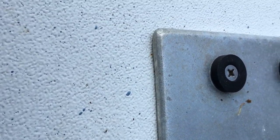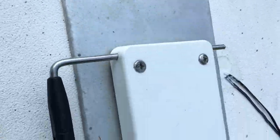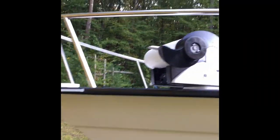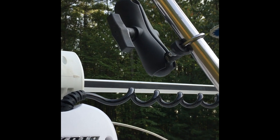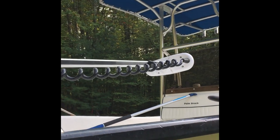This aluminum plate here — you can see how I modified it just so that the plastic plate sits above the bar rail. Everything's flush here. I had access to it underneath the hold — could get in there although it was still a little bit awkward. So now it mounts flush, because that's really critical — you don't want to have the thing sitting angled up or down. From underneath here, the motor's off — I'm just ready to take it off the boat — and that's how the RAM mount is on there, and this thing is bulletproof and rock solid even when I'm hitting waves at a decent speed three or four feet high. I didn't want it to torque that mount, so I have it secured both at the base and with the RAM mount right up near the top.